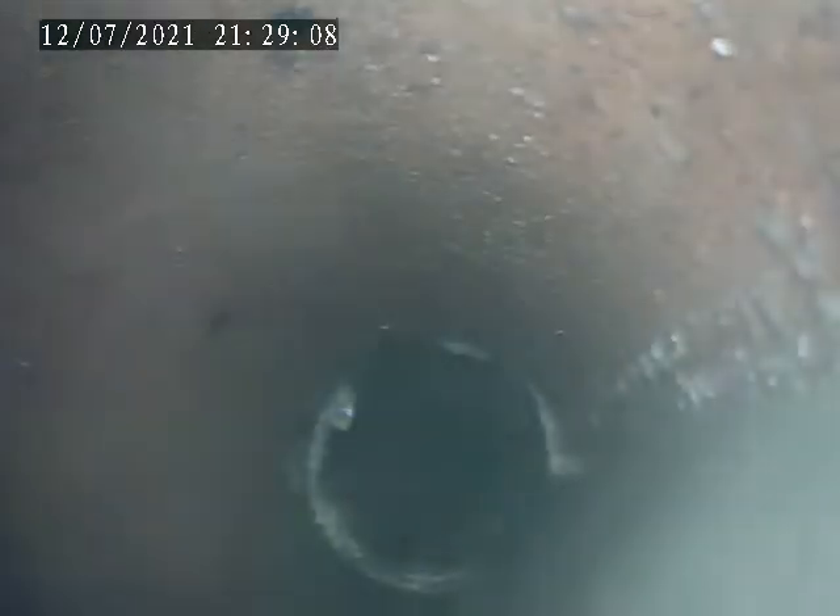Got it open. I'm recording this right now. There are a couple issues going on with this. There's some roots — three joints had roots in it, which I cleared most of them out. But other parts of the line are real sludgy, with some buildup. A couple of cracks.